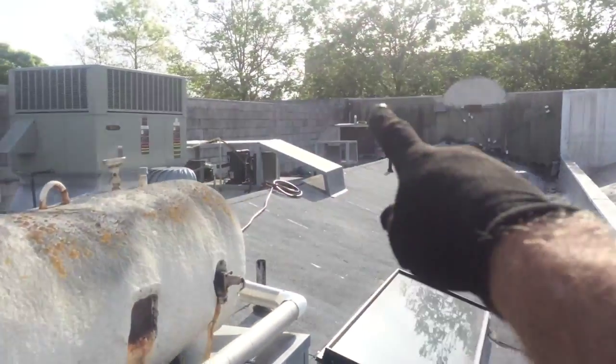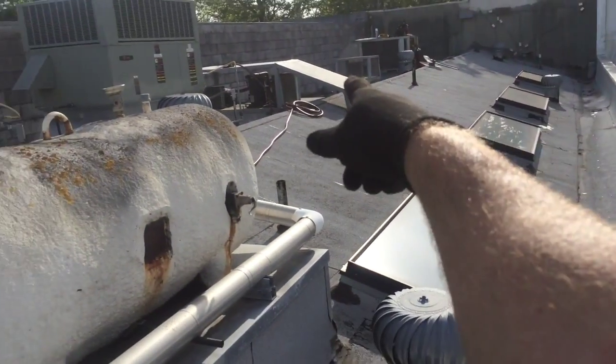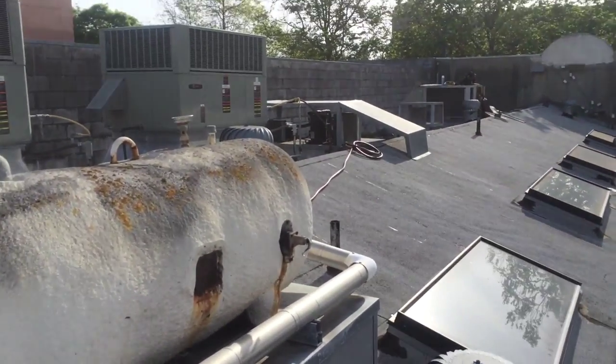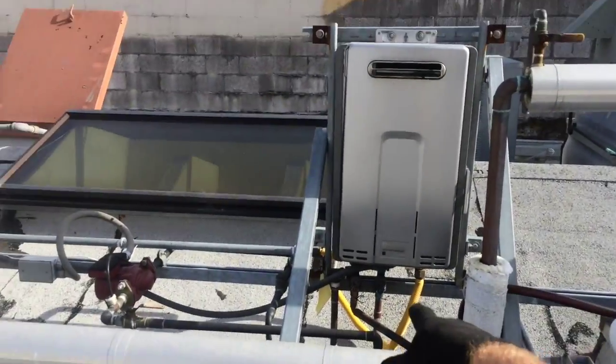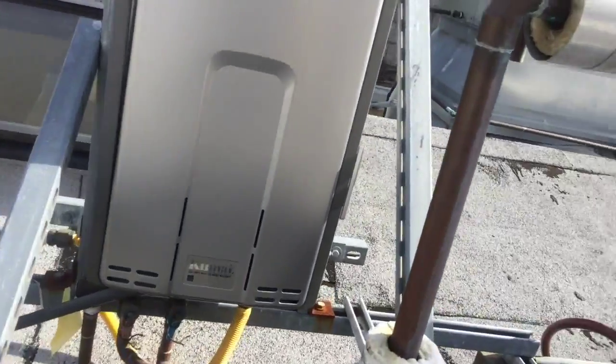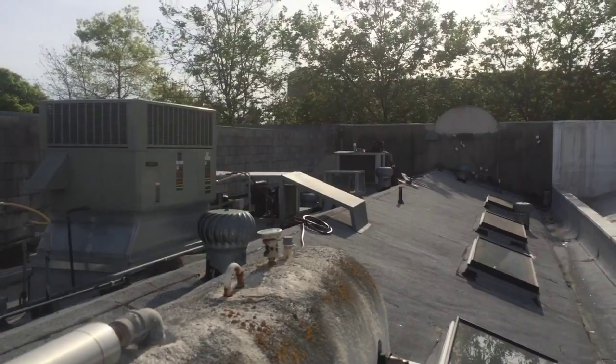Okay, so up on the roof, I'm working over there at the package unit. I'm letting the leak detector charge up. I just noticed those 2 coils for the refrigeration units are plugged. Got water right here off the on-demand. Hose bib central. I got my hose up here, so I'm gonna get those washed out, even though there's not a call for them. I'm just a sick puppy like that. I just don't want to see them all filthy.